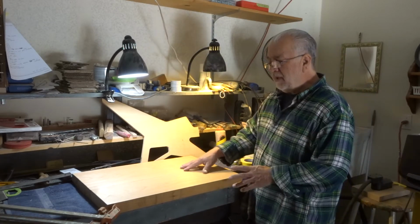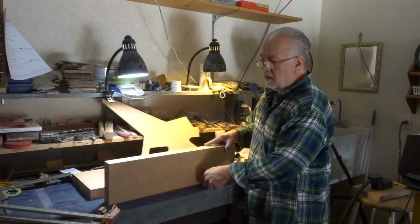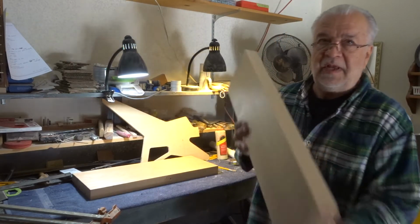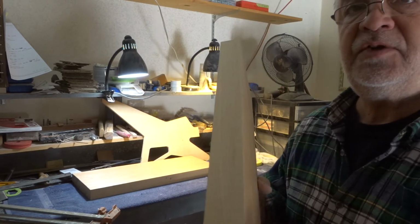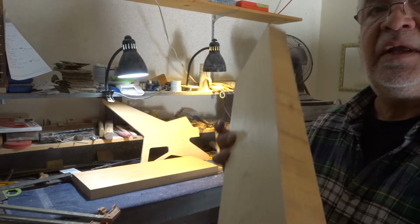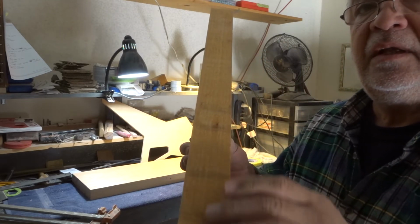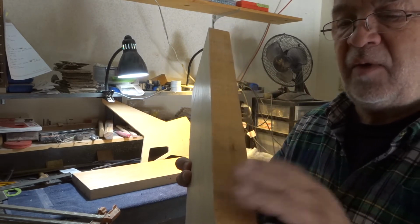So typically when you buy these planks, what they'll do is they will join one end. If I get a close-up here, we can see that this is actually pretty smooth. So that's been joined, and you can see this is a rough side. It shows the rough texture of a bandsaw cut that we have to get rid of.